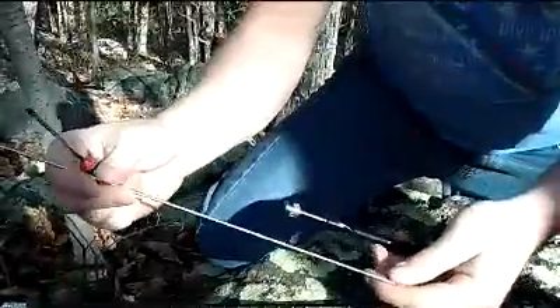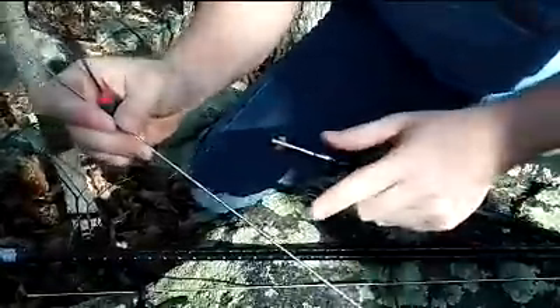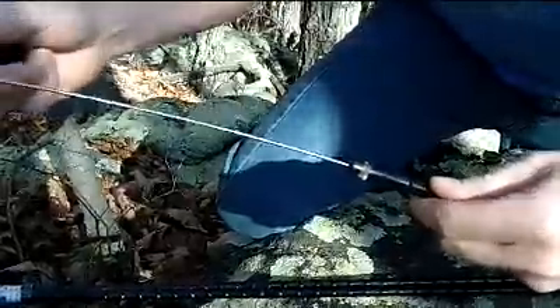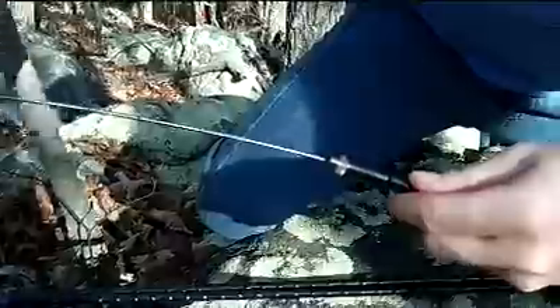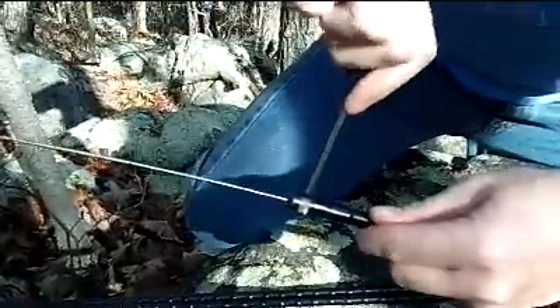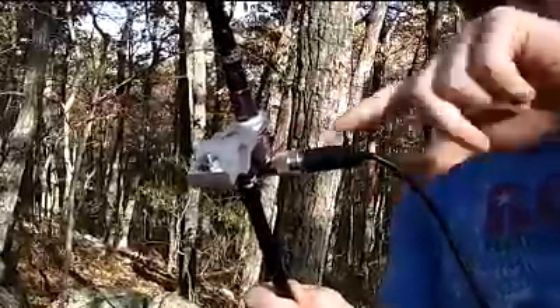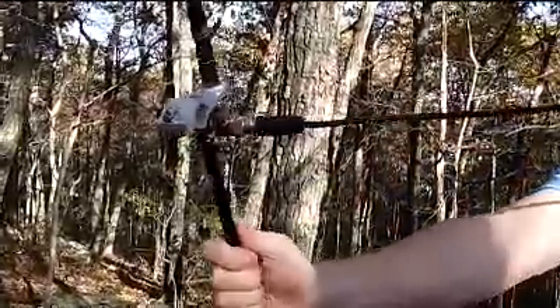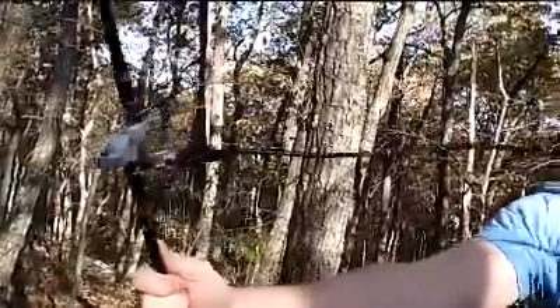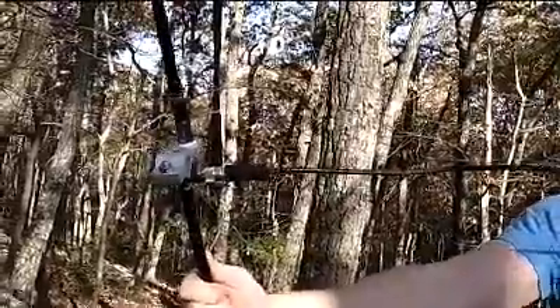As far as these stainless steel whips go, I tuned these at home and I put a little sharpie mark in there so I know exactly how far to insert my whip into the end of the antenna. I'll loosen that up, slide it right into that mark, and tighten it up. That's one side, and I'll do the other side and then I'll be ready to attach my coax. On my coax connector I have a 90-degree angle bent so that my coax can come out on the side at a 90-degree angle to the antenna, so my coax doesn't couple to the antenna itself.